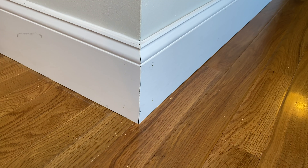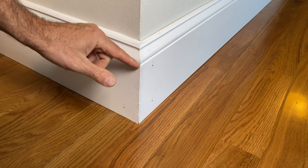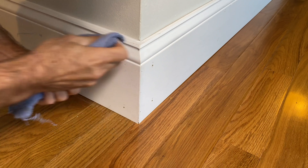On these corners there's not much to it — you'll have a couple of little gaps, just fill them up with caulk and work it back and forth to get it into the cracks. Also when cutting outside corners, they might not all be 45 degrees — you may have to play with the angle using scrap wood. I've had one that was 43 and a half degrees, and the vertical angle wasn't straight up and down either, so I had to compound-angle the cut. It just depends on how the builder did it — they're not always going to be perfect laboratory conditions.